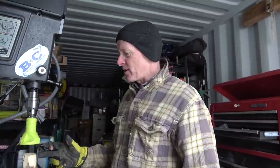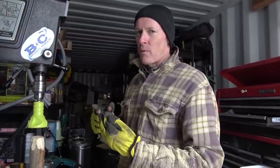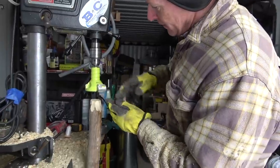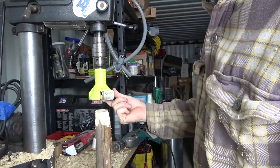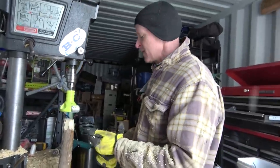The pre-taper? Yes. I think what happened was it was having a hard time, maybe a hard piece, like a knot or something, and so I was putting a lot of pressure on it. And I think it kind of warmed the blade up and then dulled it off. It had a ridge, rolled back, so you can kind of feel a little bit of a burr right now, but it still feels sharp. So I think if I'm not so aggressive, if it's not going, don't force it.